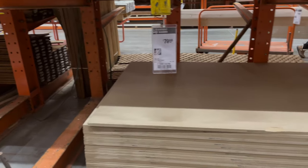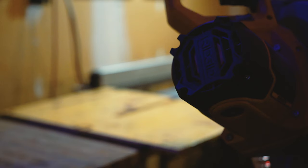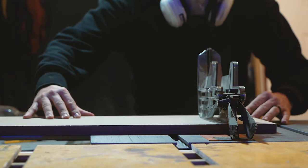My first cuts always happen at the hardware store. Conveniently, all the pieces for this build could come out of a single sheet of 8-foot by 4-foot, three-quarter-inch thick MDF. The tallest cuts are two feet and the widest are less than two feet. At the hardware store, I have them cut the sheet into two-by-two sections — makes it really easy to transport. From those pieces I cut out bottom plates, top and bottom panels, sidewalls, internal port panel, front and back panels, and the front baffle, making sure to mark them as I cut.